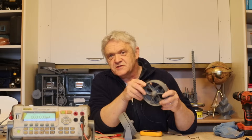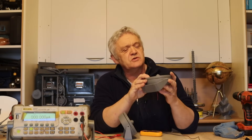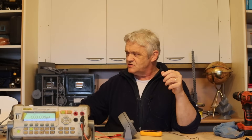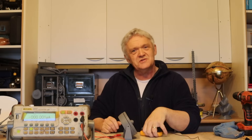That was two meters a second. So the one without tubercles was about 165 or 166 milliamps and it pushed out about two meters per second on the airflow. Now let's give it a go with this one — the same thing but with the tubercles added. We'll set it going, take a read of the amps, measure the wind speed, and see what we get.